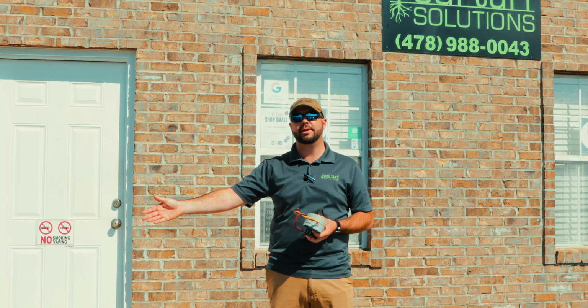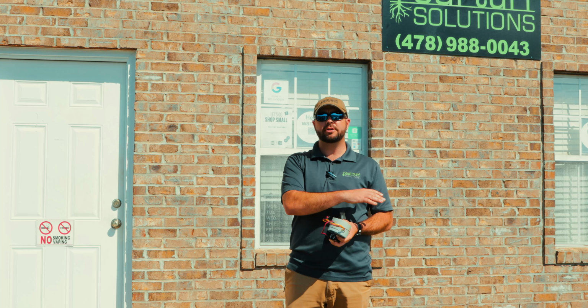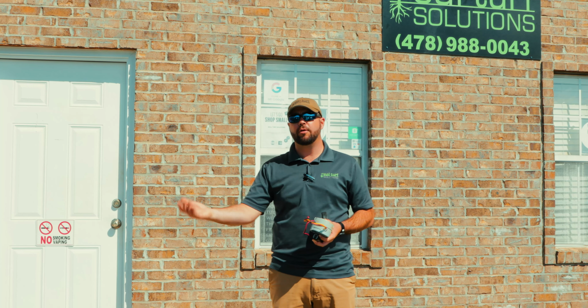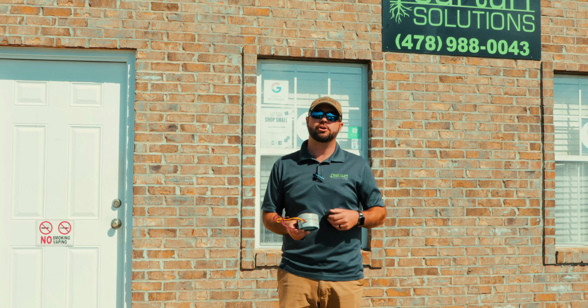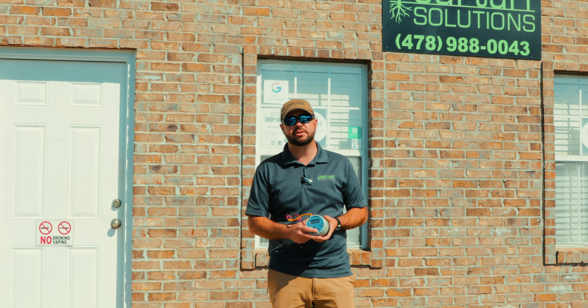Or if there's trouble where there's a cut wire underneath the driveway, and now that valve across the driveway is no longer accessible by your controller in the garage, you could bore under the driveway and put in a new wire and all that, but the cost is not quite there in your budget. So this is a more economical, convenient device.